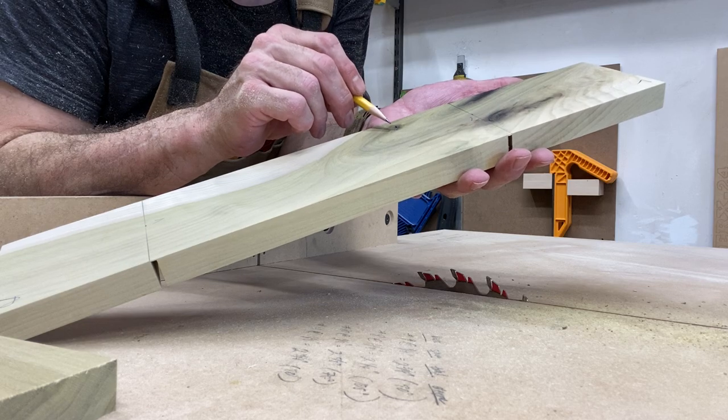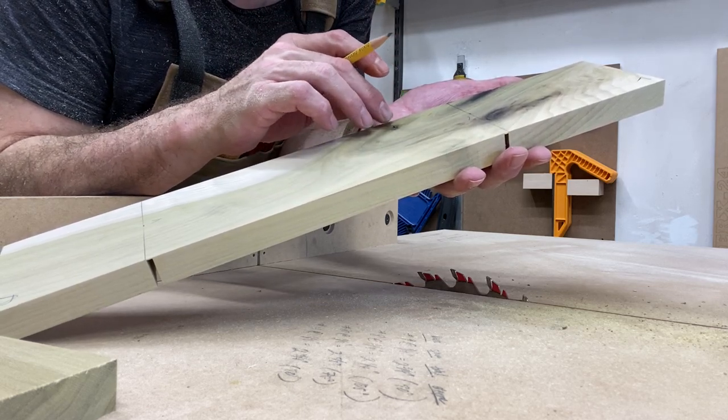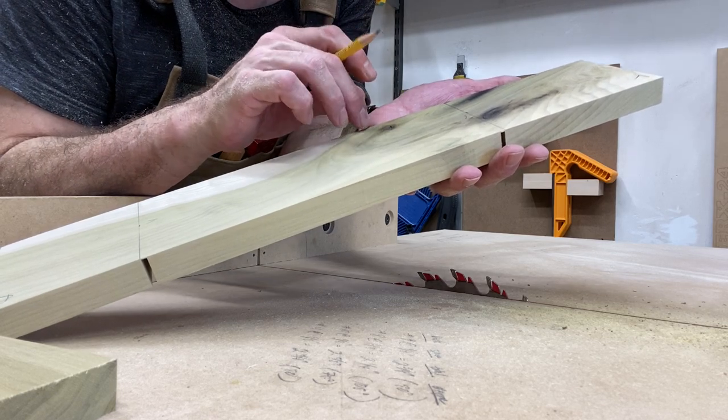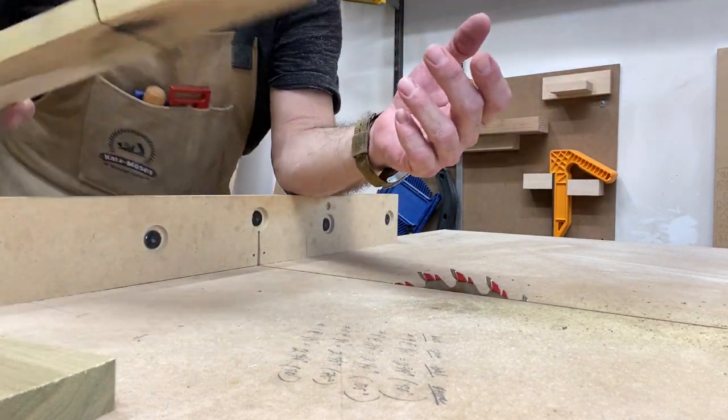If they're small like this, I would use a thin super glue first and just let the wicking action pull it in, set it aside, let it dry on its own — do that twice. Then maybe top it with a little medium and sand. It's more important that you get the thin into the cracks so when you do kerf-cut it, it won't shatter on you.